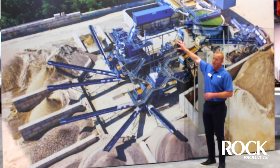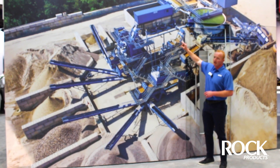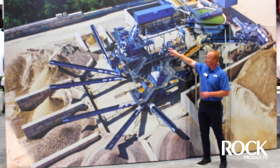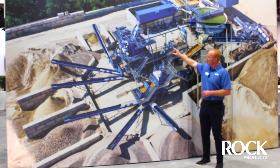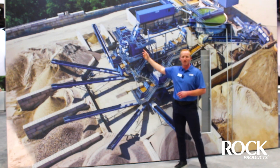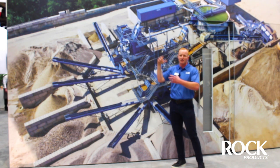In the sand plant, you get your first cut with some cyclones here and it gets dewatered. Because we want to control the hydration of the material, we have attrition cells. Attrition cells act like the AG Max but they scrub and polish the sand. Then from the sand it goes into a sump and ends up in our classifier, the CFCU 300.